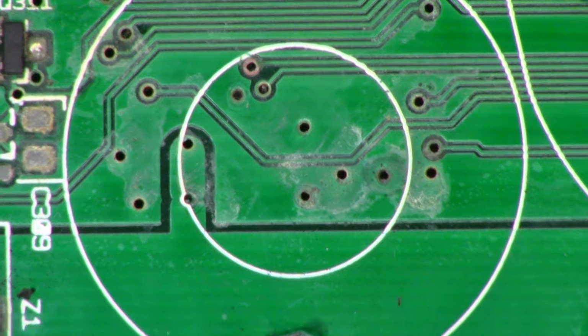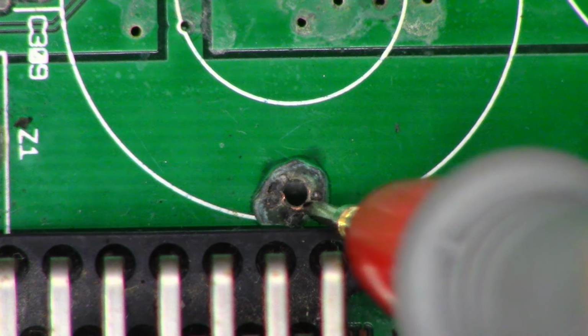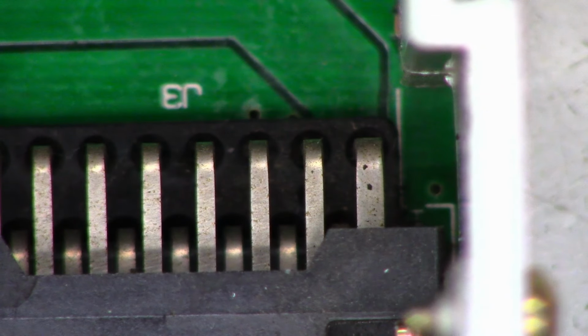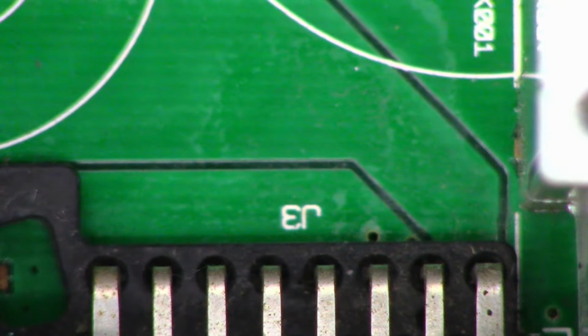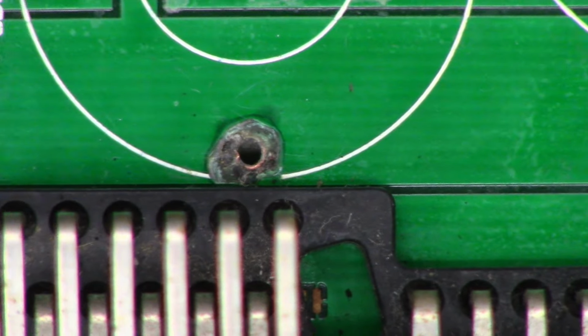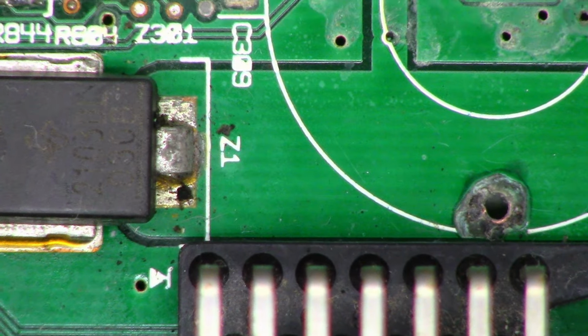So I think at this point, we just need to go ahead and figure out a way to attach power from this lead, which I think comes over here and goes to the one, well, if I can show this on screen, goes to the one big fat power lead on this side, which is probably the incoming DC, the constant or the high volt or high current DC. So I'll have to run a jumper underneath the board to repair that.